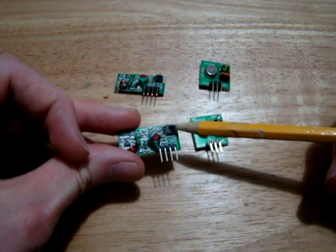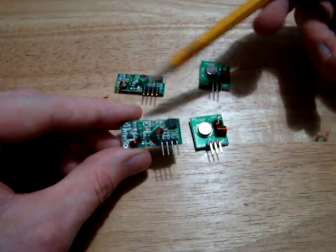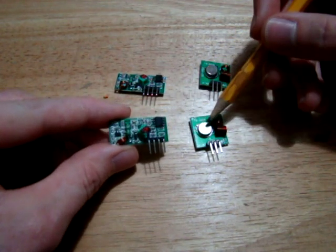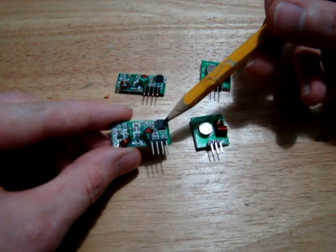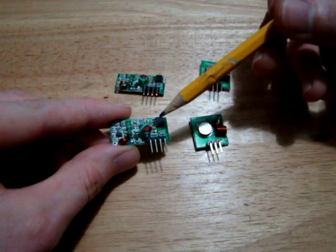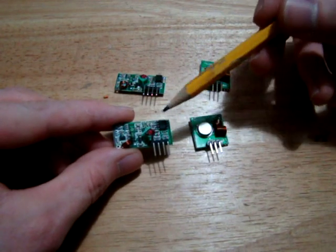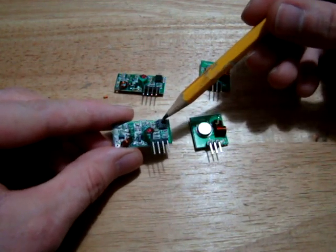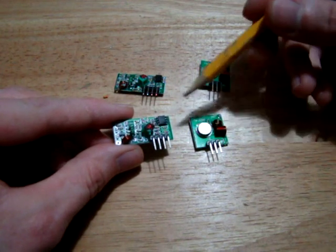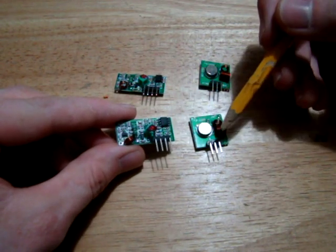It has an amplifier, and it has a little bit of control in this, because this receiver is going to constantly search for this signal, and as a result it will ramp up and down its amplifier. So when you actually transmit this signal, the amplifier could be at the wrong setting, but once it starts to receive the proper signal, it will adjust the amplification of the received signal so that you receive the proper data. But to make sure that the amplifier is at the right amplitude when you send your signal, you have to send a preamble. So you send a little bit of data ahead of the important data, so this first bit of data will probably not come through properly, but the follow-on data should come through correctly because the amplifier should have adjusted.